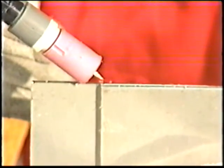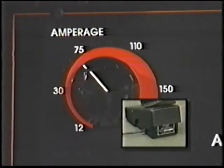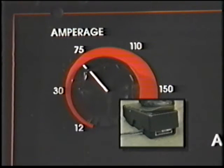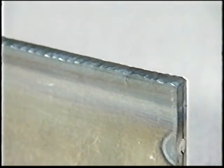We'll start with a fusion edge weld. Note that the edge of the ceramic cup is touching the workpiece for perfect positioning. Power and shielding gas control is supplied through the foot control. If the rheostat on the machine is set at 75 amps, it means the foot control, when fully depressed, will deliver a maximum of 75 amps — not the full machine output. This feature is especially desirable for additional control on thin material at low amperage. There's a half second pre-flow of gas before the torch is energized. Note the counterclockwise circular motion technique for right handers — the torch is held at a 10 to 20 degree angle to the direction of travel. Left handers should do the opposite.